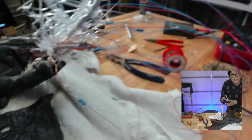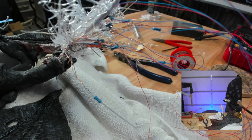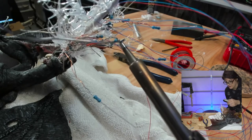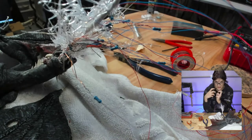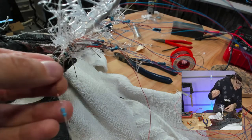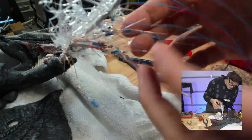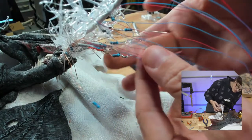And maybe it's time to move you guys just a hair again. We're rocking the positives. The soldering iron is just not... I'm soldering floating a little bit. Normally I like to position my elbows or have an anchor. I'm just free-floating a bit. Not the best way to do it, but it's working. All right, I want to make sure I'm not missing anybody. So this guy is probably next in line. Let me see if anybody else, especially some of these big guys right here, the larger LEDs, I want to make sure I get them. But I think we're doing pretty well.